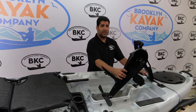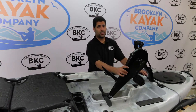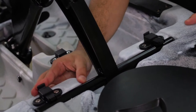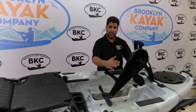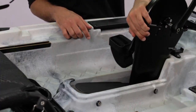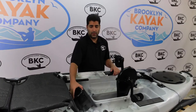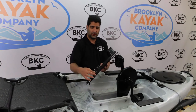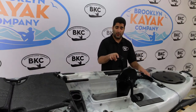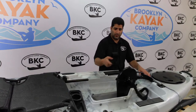This pedal drive is cast aluminum and the complete exterior is fully powder coated, so it's anti-corrosive. You place the bar in here and lock the two pins — you're currently in the hinged position. To lower the prop into the water, you simply straighten the prop, drop it into place, lock the third pin, and replace the cover using the bungee cords and knobs.